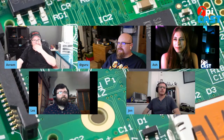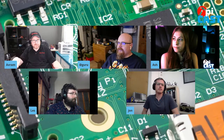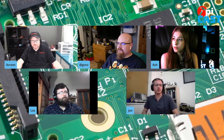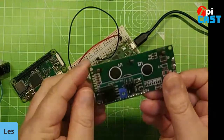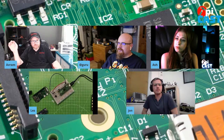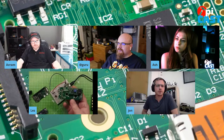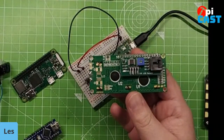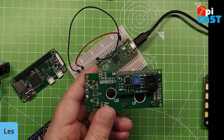I know this is only 3.3 volts and those LCDs tend to want 5 volts — have any of you tried one and does it work at 3.3? We actually carry a variant of that specifically designed for 3V3. There are probably some unpopulated pads on the left of the board that make the whole thing 3V3 instead of 5 volts when populated.